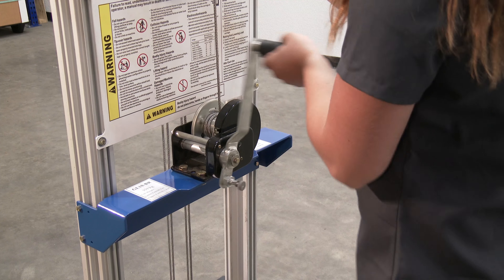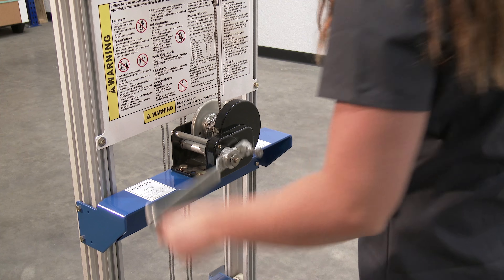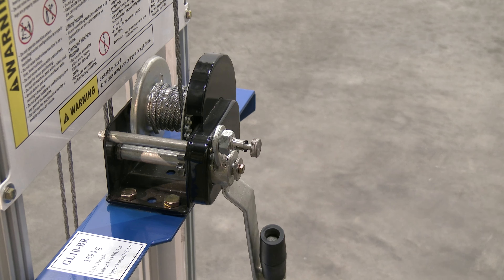It is operated by a hand crank winch that features a reversible handle and a hold-down device for securing the carriage during transport. Forks raise 1 inch per complete hand crank rotation. The non-adjustable forks can be inverted to provide different height ranges.